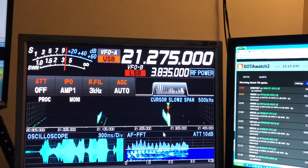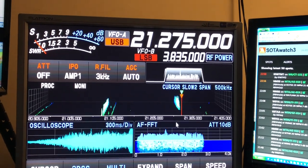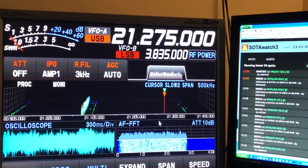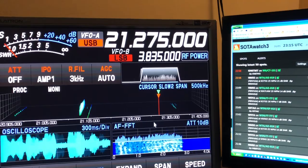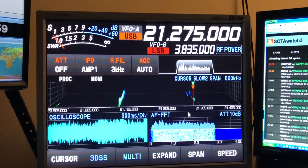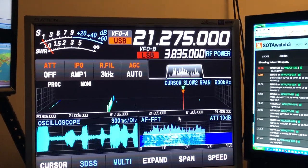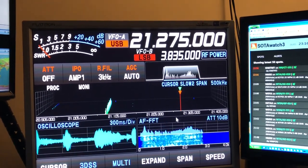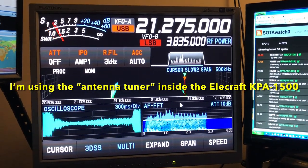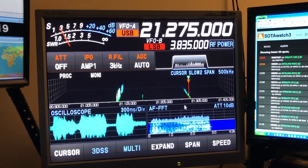It's got a pretty good signal off the vertical. Look at the noise floor. Now back to ZS6BKW, kicking in the tuner. There's the signal with the vertical — the weaker station — becomes the ZS6, no tuner, and there it is with the tuner. It's almost midnight for him on 14.253.